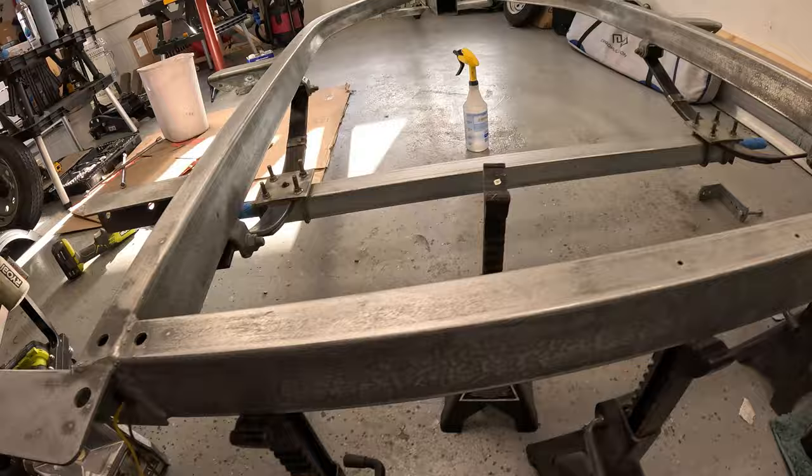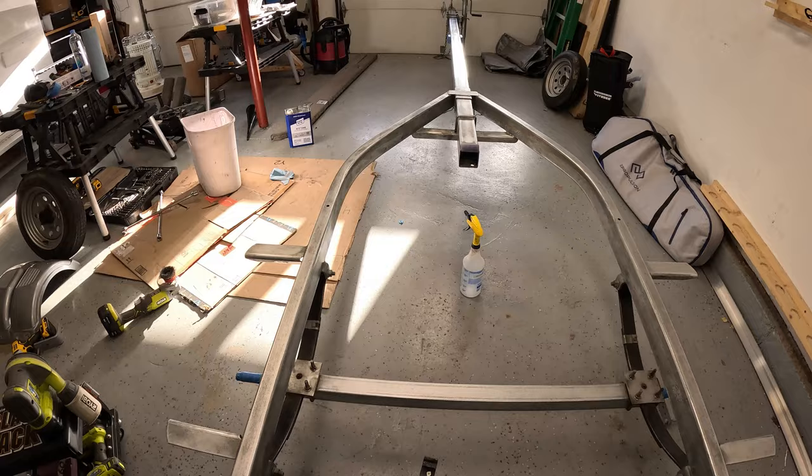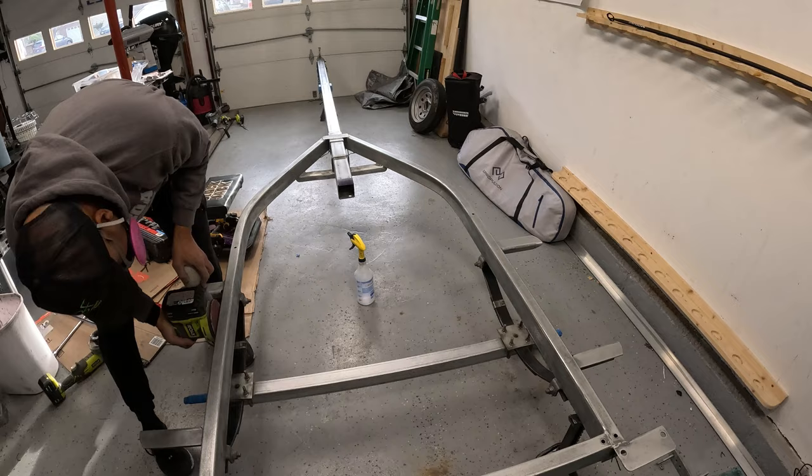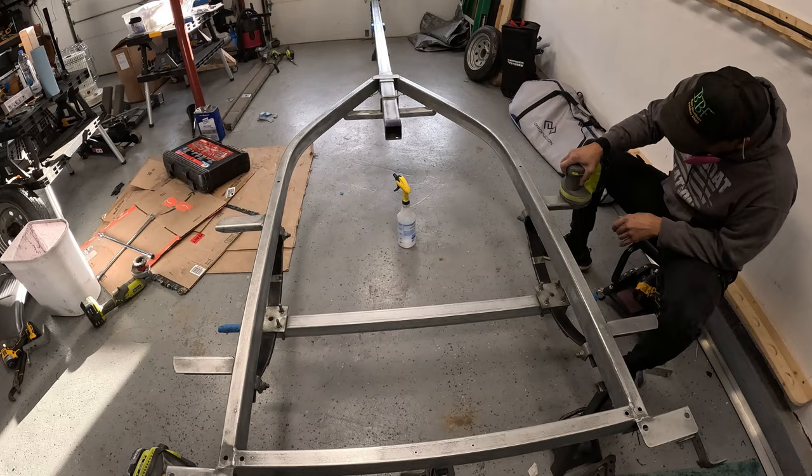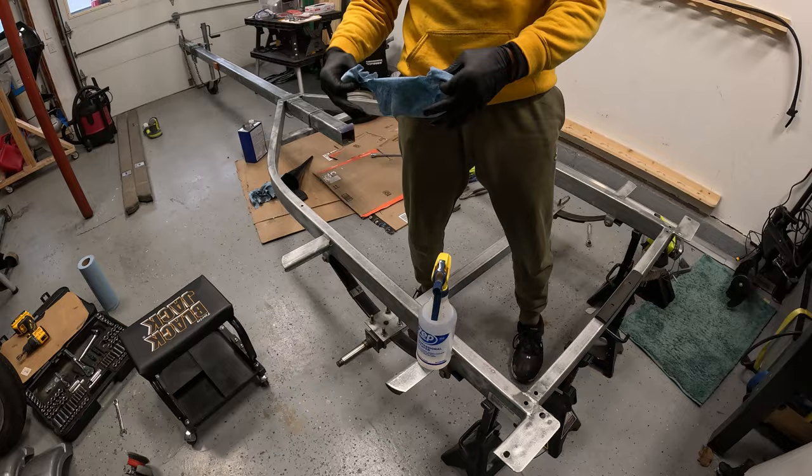The last time I sanded was last night, so I'll do one more light sanding today — not getting too heavy or deep, just running over it with 220 on the orbital. This way, any kind of overnight oxidation — I know that sounds crazy, but within a 24-hour period you never know — it's aluminum, so it's always a good idea to sand one more time. After sanding, here's the wipe-down with acetone, giving it a really good wipe-down and changing out the towels frequently to ensure I clean the surface properly.